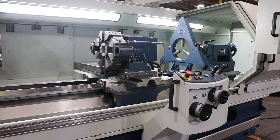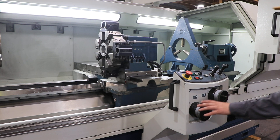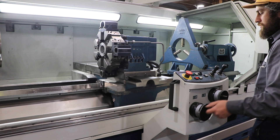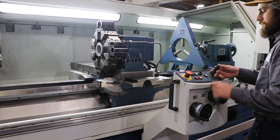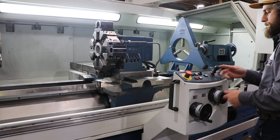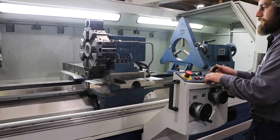That's the steady rest, which is a roller-type steady rest. Steady rest capacity is 10.4 inches. Those are your hand wheels. The machine also has threading modes — you can do inch and metric threading and all different threading cycles.